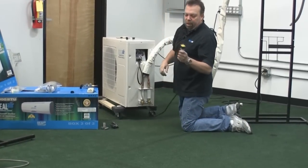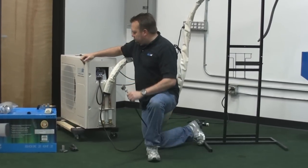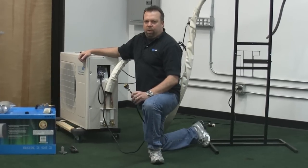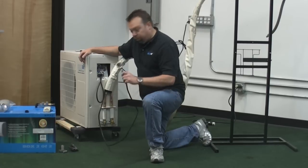I've already put a plug in on the end of the cord, but you'll have to wire this in yourself. You want to make sure that each one of these units, whether they're 240 volts or 120 volts, has its own dedicated power circuit — they need their own breaker. This is very important.